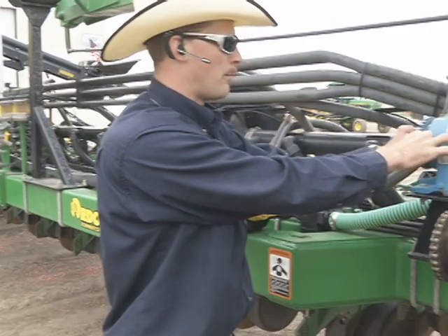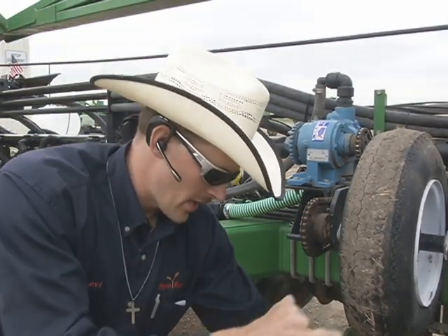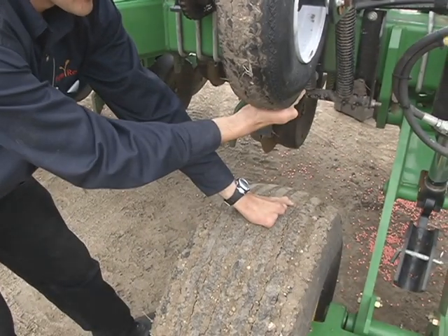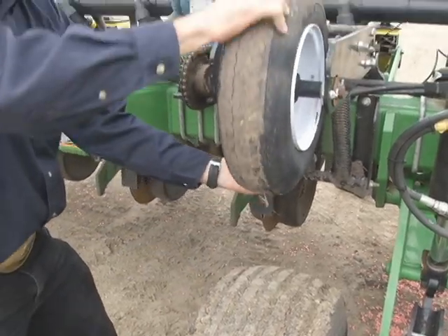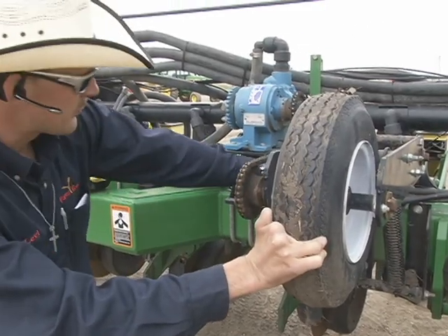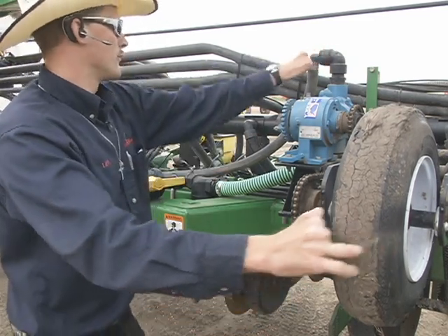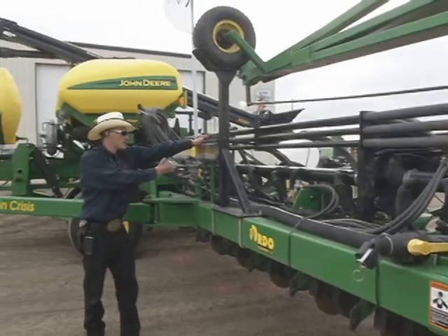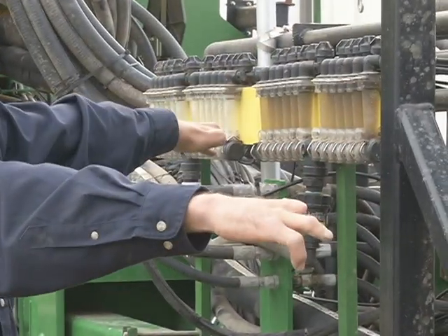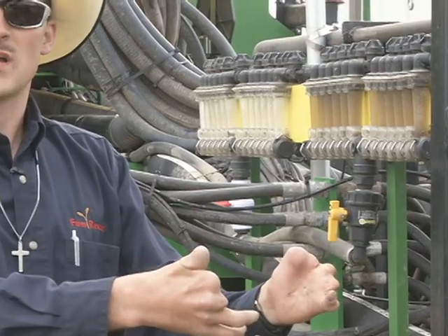Here is your pump. The pump is driven by this wheel. When the planter lowers into the ground, this wheel comes in contact with the wing wheel — so these two touch together. When this wheel turns as it's rolling forward, it causes the other wheel to turn, which engages the gears back here, engages the pump, and pumps your fluid from the tanks through the line, up through the top, all the way across to your plenum. From this distributor plenum, it goes to each of the individual row units, right into the furrow, placed right next to the seed — to either give it the fertilizer to get started right away, or the insecticide to keep the rootworm from eating the seed and causing poor yield and poor stand.